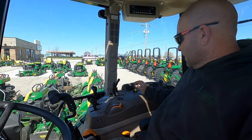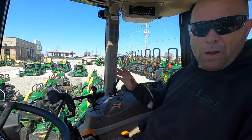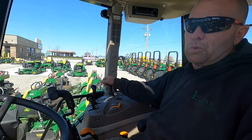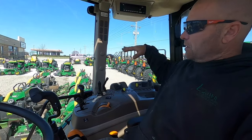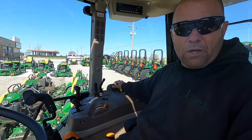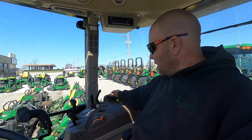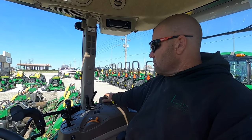Your draft arms are right there, but then it's got the electric draft arm up and down, which is kind of nice. When he was telling me he had the full electric like I had in the 4 Series, I really like it. If you're doing a bunch of three-point work - doing snow, picking the box up and putting it down, mowing a tight spot - you're already doing enough with the shuttle and everything else. With this you want it up, just push it up.